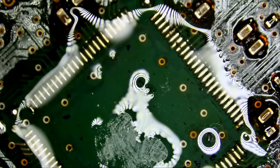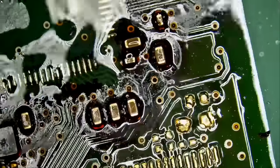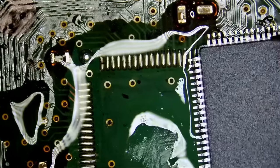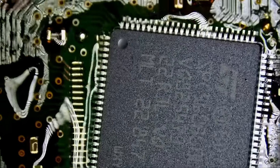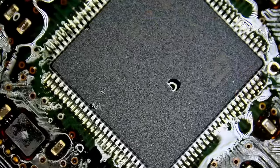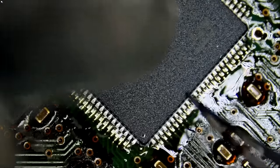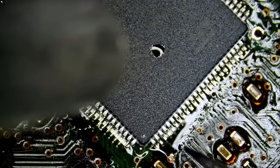Now we're gonna grab that chip, and again, where's pin number one? Pin number one is right here. That's the virgin chip. And pin number one is gonna align with the mark that we have on the board. We're gonna align it and then apply hot air. Now let's go ahead and see if we can reflow that chip. It doesn't have to be perfectly aligned now. Once solder melts on the pads, then we can move that chip down in place.